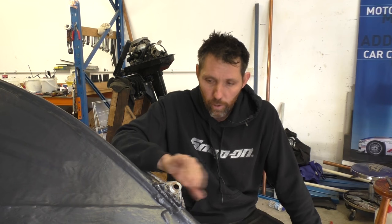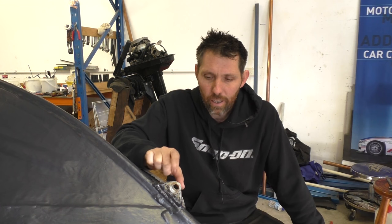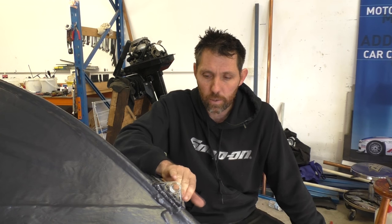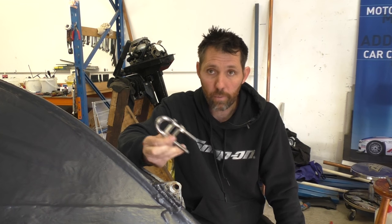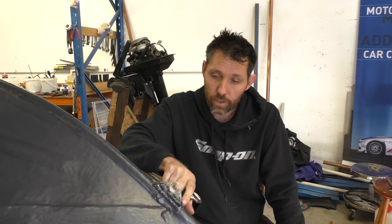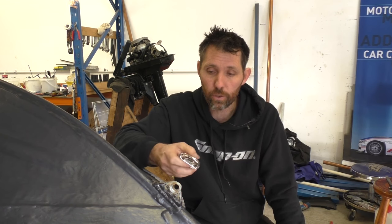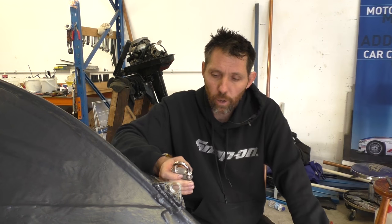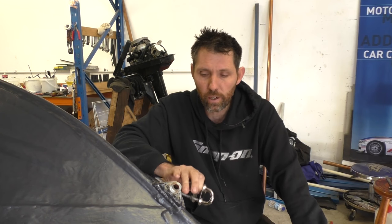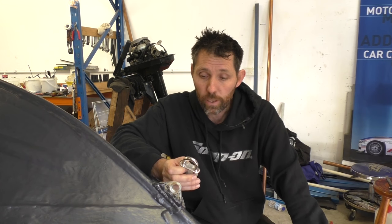My plan is to actually cut this one off. I did toy with welding some extra metal over the top here, but at the end of the day, aluminium is a softer metal than the steel shackles that go through here, so I'm happy to replace this with something stainless. My plan is to use something like this — a stainless tow-eye, pretty much made for this job. I'm going to cut this old tow-eye off, then I'll grind the surface here on the stem as flat as I can, so that I've got a good surface for this washer section to rest on. Then I'll probably put a bit of Sikaflex through the holes as well, just to make sure it's not a leak. It is above the waterline, but it's not going to hurt. So we'll get started.